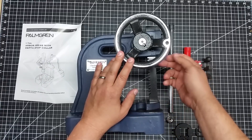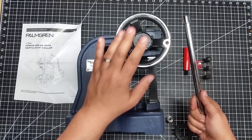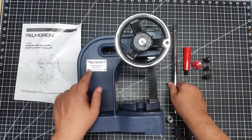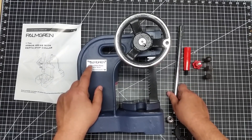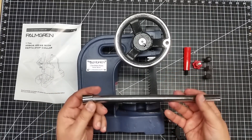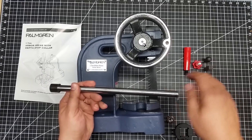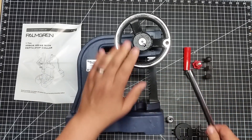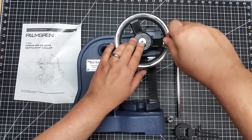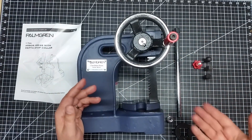This wheel goes on here and allows you to work the arbor. The idea behind an arbor press is you have this geared arbor — I think it's about a 20-to-1 ratio — and you convert the leverage of the handle through the gear ratio to the arbor, which generates according to this about a ton of pressure. You can increase that further. This rod is about 16mm diameter — pretty heavy duty. What I've seen other folks do is get longer rods and insert them to get more torque, or just put a pipe on the end, because obviously the longer the lever the more torque you have.